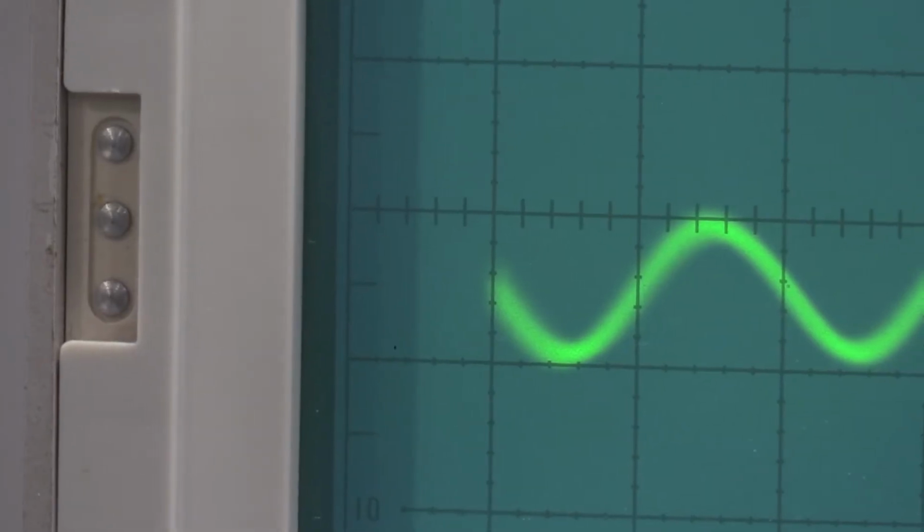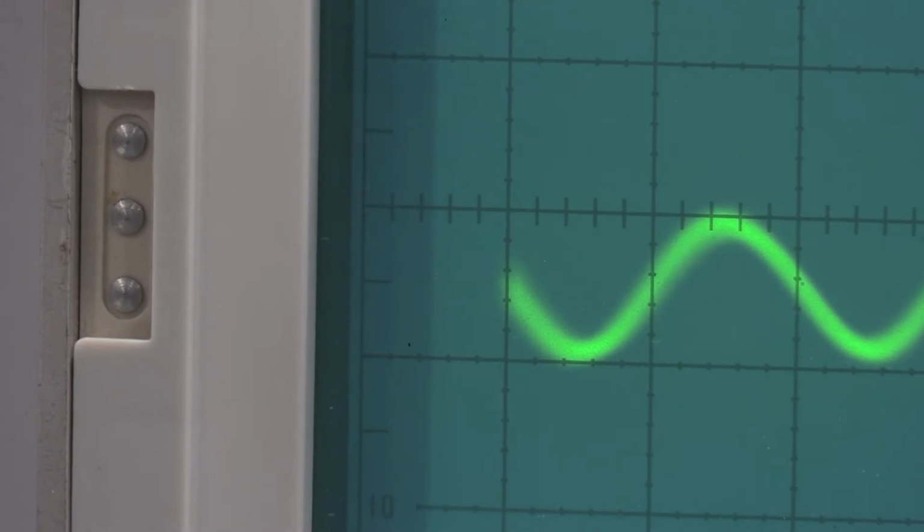Okay, so we're going to adjust the delay time now. Delayed trigger runs after delayed time, 10 microseconds. What you need to do is change the slope, and we're referencing this for CRT 0. It's actually still telling us not to have moved the position control on the 7826. But let's see what this does. This is pretty much right in the middle. That is absolutely perfect, actually. So we're not going to mess with that at all.